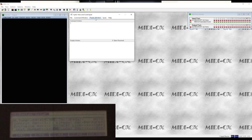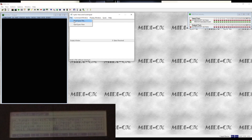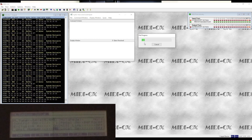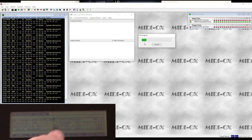Click OK, then go to the File menu and select 'Send SysEx File.' It opens your SysEx files — select the one recorded in the backup video. You'll see the file start to transfer from the computer to the keyboard. What you'll notice is the keyboard doesn't say it's doing anything — there's no progress meter on the keyboard, none at all. The only progress indicator is on the computer. This process will take about three minutes.